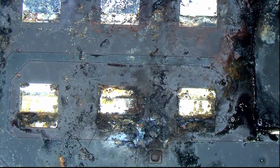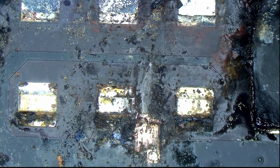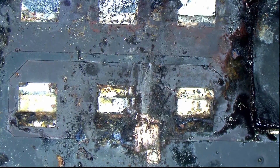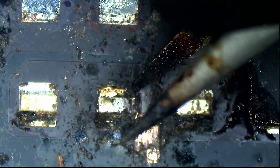It looks like our short circuit is actually somewhere inside the motherboard itself, because even after all of that, it's inside the board. All those caps are removed and it's clearly in here. This is a very, very thick trace for its power for the CPU, so there's very little chance of any of us digging that short out of the board — this is for a very high power line. It's probably merged really deep in there. All right, so instead of a Dremel, we have a drill. Same difference, though.